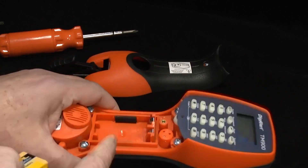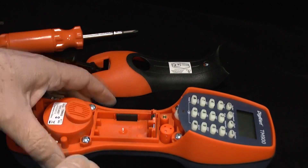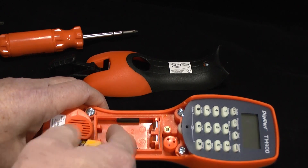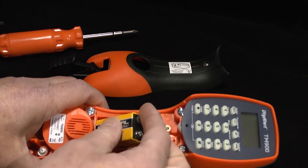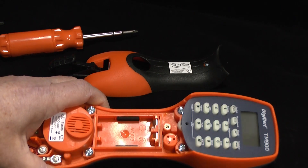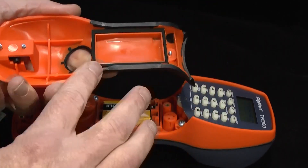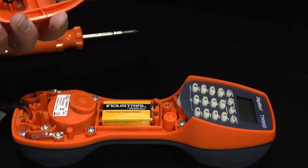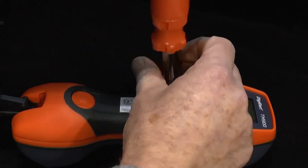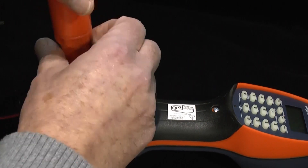The battery itself is fitted into this area up here, so just check there's no dirt on the knife edge that goes around the battery. If you look into this hole here, you can see there's actually a breathable membrane which keeps the enclosure inside at the same pressure and vapor pressure as the battery compartment. There's another one here outside the battery compartment area which allows breathing of the main compartment into open space. The battery itself has a secondary seal. Replace the cover and retighten — just finger tight, nothing has to be super tight.